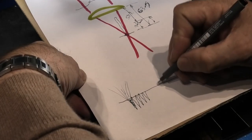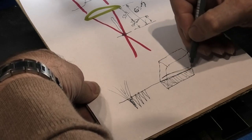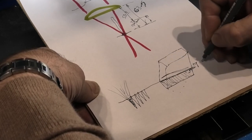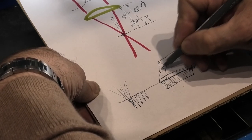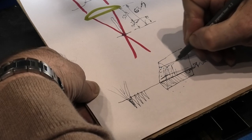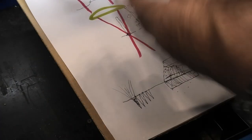Like that. Now, when you're doing a continuous engraving cut like that, the only way for the fumes to get out initially on the first line is this way. So as the cut goes that way, the only place for the fumes to go is out along the kerf. And they will blow out along the kerf and they will settle on the surface here. Now, as you get further and further into the cut, you've got two dimensions of fume movement. One, the fumes will tend to go this way, away from your cut, because hey, there's nothing there to stop it. It's like a cliff edge. So the fumes that you're producing are going both this way and that way, and they're just covering your job.